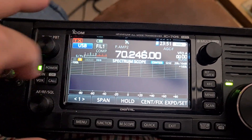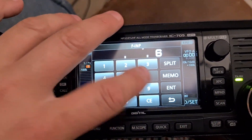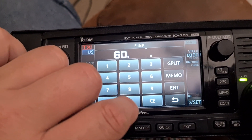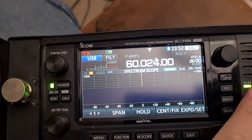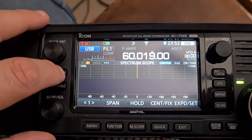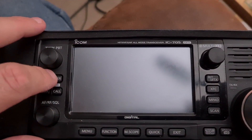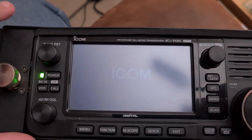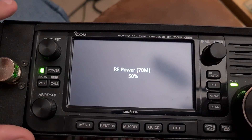I wondered perhaps that's because I'm on 70MHz. Being a wide-banded radio, I thought I'd try 60MHz, so I typed in 60MHz, and you'll see it still does something there — if you put an antenna in you can hear stuff on that frequency. I noticed it still says 70MHz (brackets 70M) on the screen when it powers up.